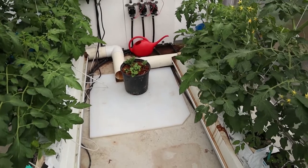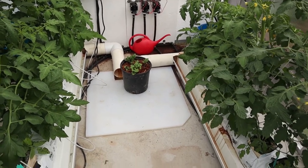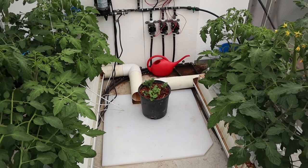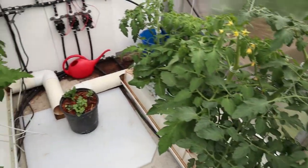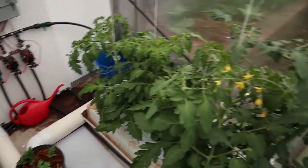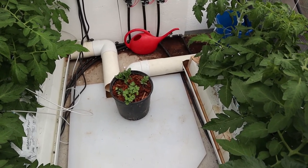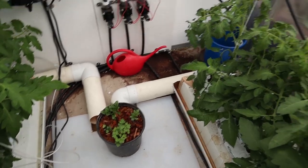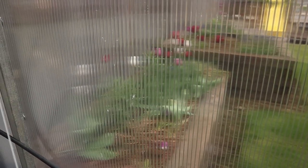The reason I hacked a hole in the concrete was for drainage, and also so I can put a sump pump in there to pump out that water. I'm also going to recirculate that water into my grow towers, so the water that leaches out of the plants through the gutters will flow down into the pipes, into the barrel, through the grow tower, and be recycled. Every once in a while I'll pump it empty, add fresh fertilizer, and take the nutrient-rich leachate water and put it on the flower beds outside.